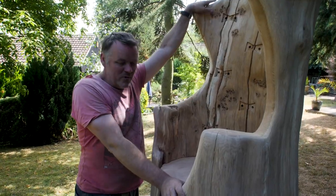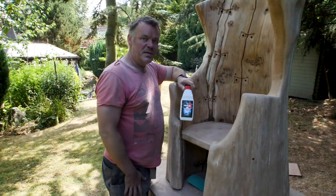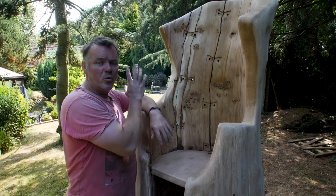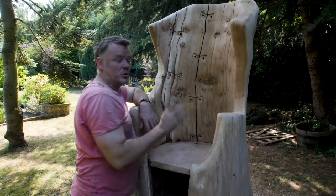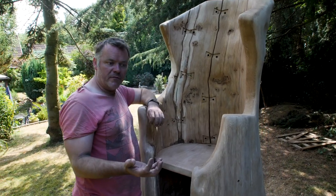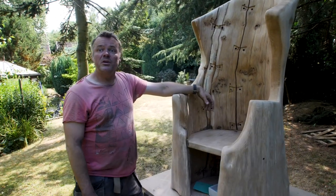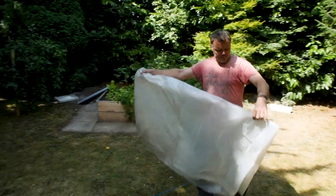Anyway, we've decided what we're going to do is a traditional finish. We're going to use some ammonia, and we're going to fume this overnight. So we're going to get loads of variation in this. I think what you'll get is all the way from really blonde through to walnut black. So it should be quite interesting. It should take it really well. Again, it's in keeping with the finish we want to achieve, this 1,000-year-old look. Let's call it a 2,000-year-old look. Let the ammonia do its thing. So that's the next move. Let's go.